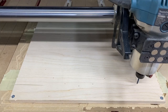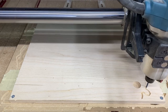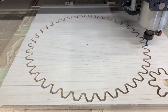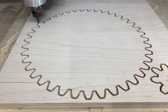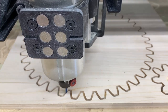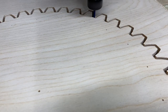This file is for the gear pulley — it's going to pocket out a recess for the adapter. The adapter will sit right in there friction fit, and then you can use the shaft of your motor to connect to that pulley, giving you a wooden gear. The CNC now does the hard part: cutting out the large gear. I've done this before by gluing a paper template to wood and cutting each tooth on the band saw, then sanding so all teeth mesh correctly. With the CNC, it's super easy — it walks all the way around, does a full perimeter cut at full depth, and now you have your Ferris wheel and driver pulley.